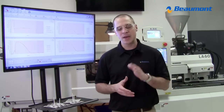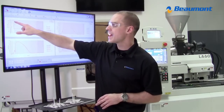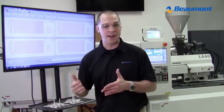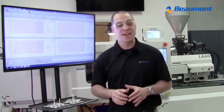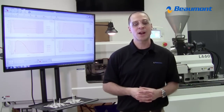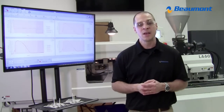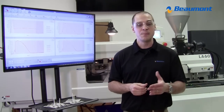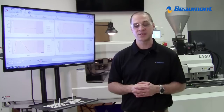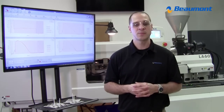Another big benefit that I want people to understand with this MeltFlipper is that when you see that you may have a little higher fill pressure after putting MeltFlipper technology in, this is not a negative thing. This is a huge benefit. Because remember, in this tool, I put 8% more volume of material in during that fast injection rate, minimizing the effect of material viscosity changes. So I hope this demonstration will help you understand MeltFlipper a little further.